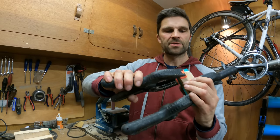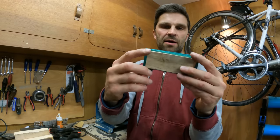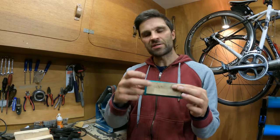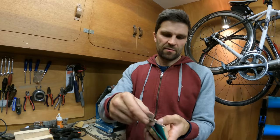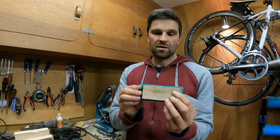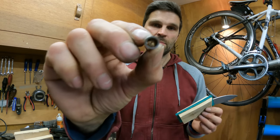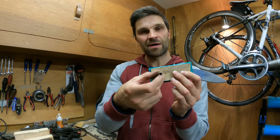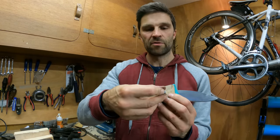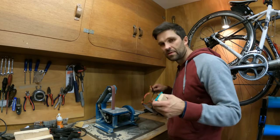The best glue to use is the Gorilla Glue original, but the problem is it's absolutely rock solid and I can't get it open, so I'm on the second best thing which is the Gorilla Glue epoxy. I'm just going to mix some of this up on this offcut of wood. I've just got a tiny little spatula thing here — a packer for fitting windows and doors. Give this a nice mix, make sure you do it well, and then all I'm going to do is just paste this onto the liners and clamp it all together.